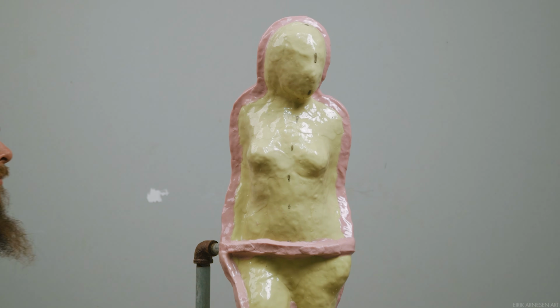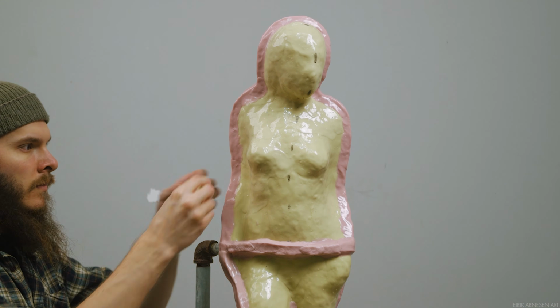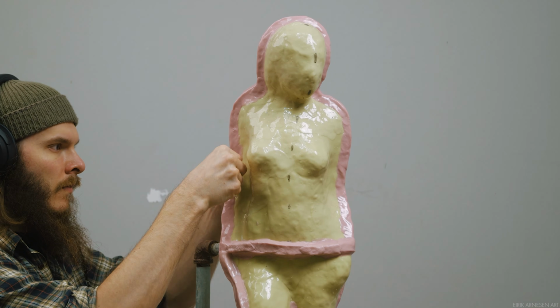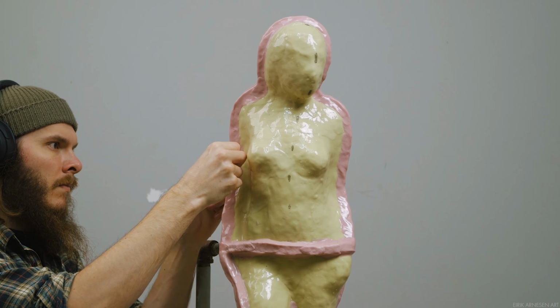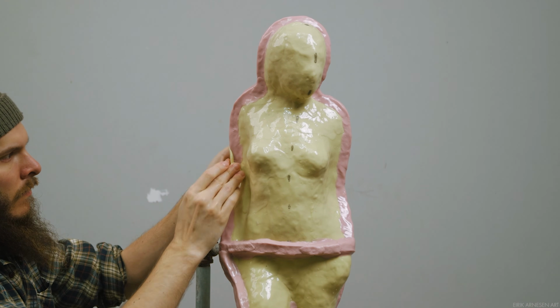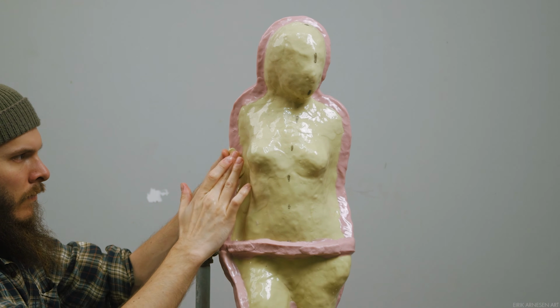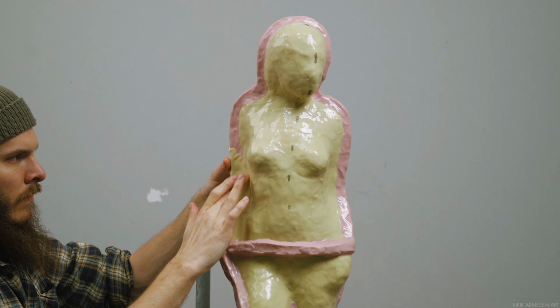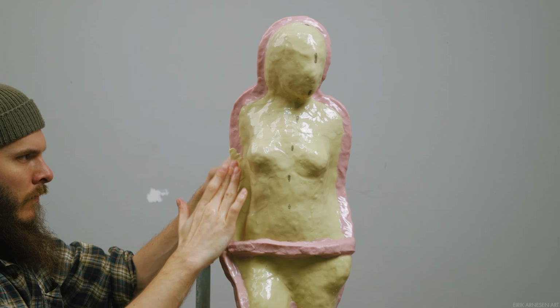The third pass is the beauty pass. To give myself the best chance of making sure my wall is nice, square, and neat, I use yellow catalyzer for this step, so I have a little bit more time. It's going to set up slower and is more prone to sagging, of course, but the amount that I need to add now is a lot less than what I needed to add earlier, so sagging becomes a lot less of a concern, and I also have a lot of support.